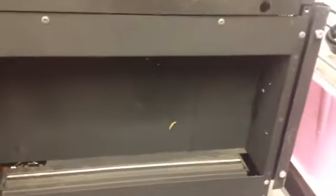Carbon monoxide doesn't smell, but you will quite often smell if it's burning badly. Obviously get these serviced once a year. There are a couple of these that have got little triangular blocks that sit over the flame, and quite often they crack or turn slightly - you'll get a horrible flame running up there, which means you're getting the wrong things coming out.